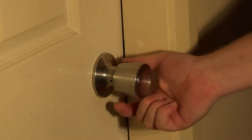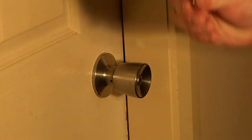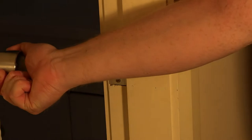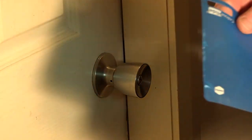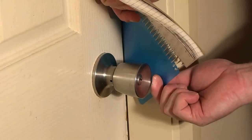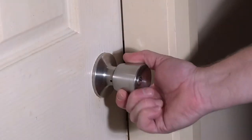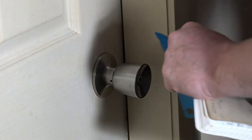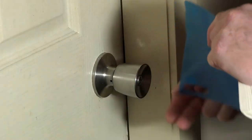So you're outside the bathroom and the little lad or lass has locked the handle on you from the inside, and you need to get in to check they're alright. You could, as stated, use a small coin to turn the privacy override on the outside of the door — that slot there. If you can't find a coin and need to get in in a hurry, you can find something like the good old notebook from the last video. You'll notice this door's got a lot of play in it, which makes this very easy. Try that again — there we go. Sometimes, just to make it a little bit easier, you might just need to give the door a bit of a wobble. It just releases and helps the latch slip a little bit easier under the pressure from the edge of that piece of plastic.